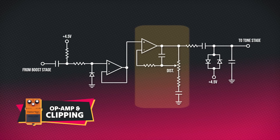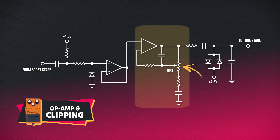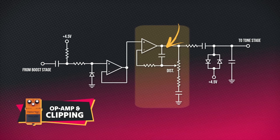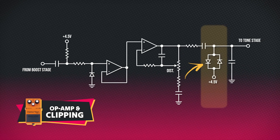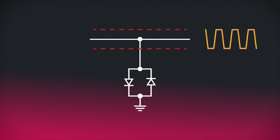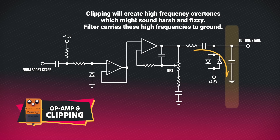The feedback network of the second op-amp contains the gain control, labelled as 'dist' on the pedal. Varying the resistance of this potentiometer will affect how much of the signal gets sent back through the feedback network, controlling how much amplification the op-amp provides. While this capacitor here ensures that high frequencies are always bypassing the gain control, reducing the overall high frequency overtones at the output of the amplifier, taming the high-end fizz that's often associated with distortion. Beyond that we find a pair of hard clipping diodes connected to AC ground. These will conduct away any signal above 0.7 volts on either half of the waveform, squaring up the distortion response further. This capacitor to ground acts in conjunction with the resistor to bleed off some high frequency overtones generated by the clipping, with the filter's attenuation tied to how hard the diodes are conducting.